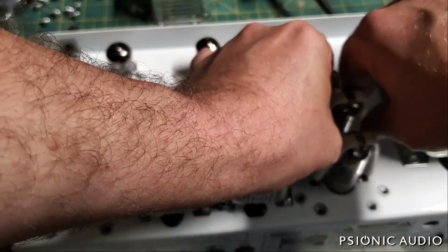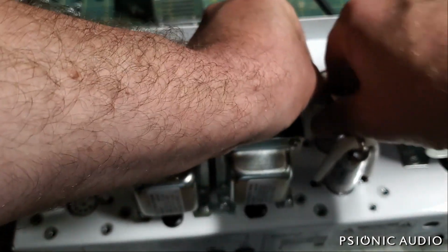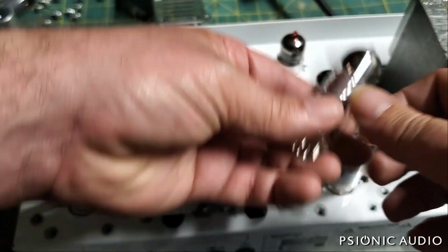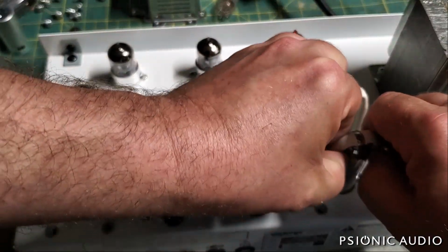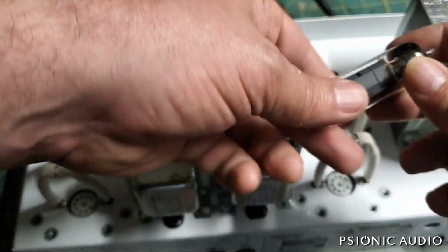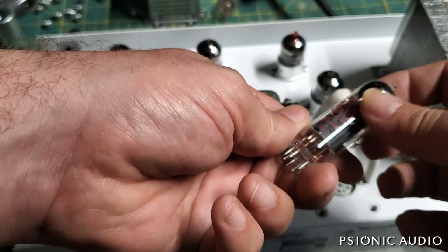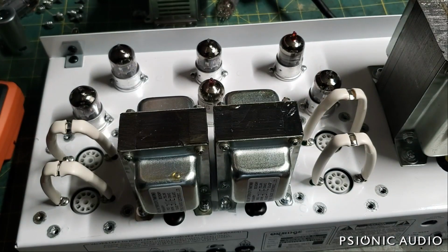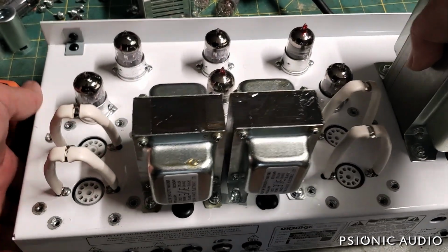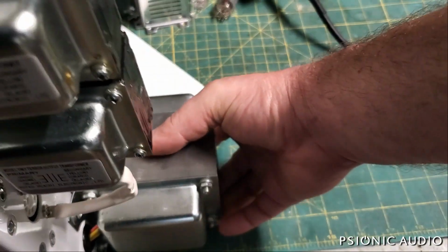These are JJs. That does not mean there's anything wrong with JJ EL84s. But many amp designs, that one's faded as well, severely punish EL84s. If it's a cathode bias amp, they often bias them way too hot with no screen grid protection. If it's a fixed bias amp, like the Blues Junior, they often have a non-adjustable fixed bias, which also biases the tubes way too hot, often also with inadequate screen grid protection.